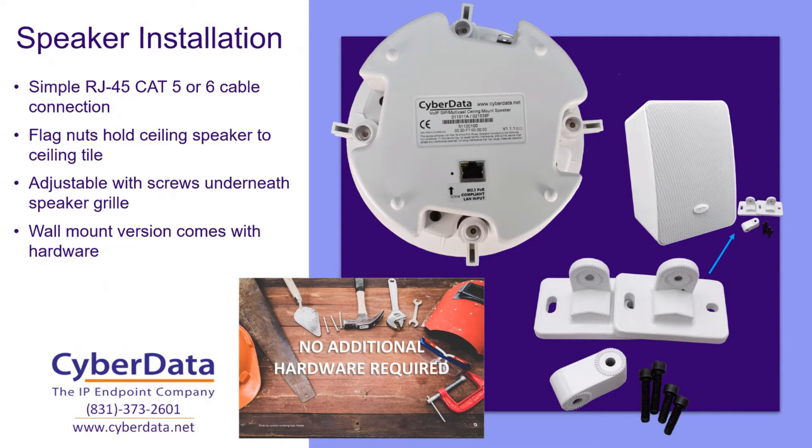For actually installing the speaker, the nice thing with our ceiling mount speaker is they've got these big flag mounts on the side. They can actually sandwich between the front of the speaker grill and the ceiling tile — that's why you don't need any additional mounting hardware. They kind of pop out and hold the back of that ceiling tile to the front face plate of the grill so the speaker is nice and sandwiched in there. It's also got an earthquake strap that'll really hold it up, especially out here on the West Coast where we get earthquakes — it prevents that heavy speaker from falling out of your ceiling. As with the majority of CyberData products, these are going to be powered via PoE, so you can just use your standard RJ45 with Cat5 or Cat6 cable to power and control the speaker.